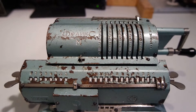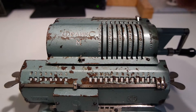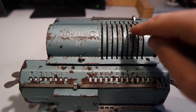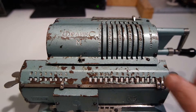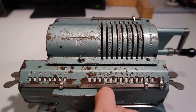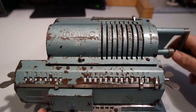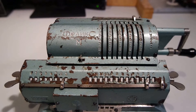It's also possible to multiply numbers with decimals. Let's try to convert inches to millimeters. Let's say three and a half inches: we have one decimal place here, 3.5, and we want 25.4 over here — that's millimeters per inch. We have a total of two decimals, so three and a half inches is 88.9 millimeters.